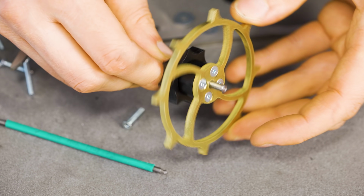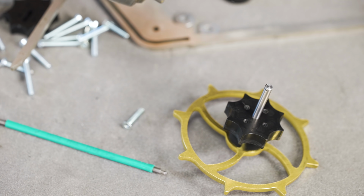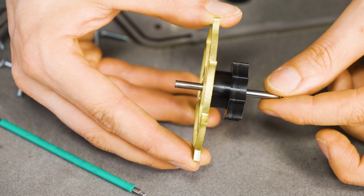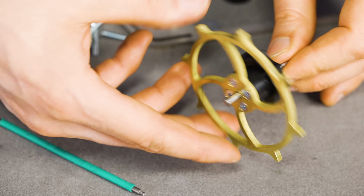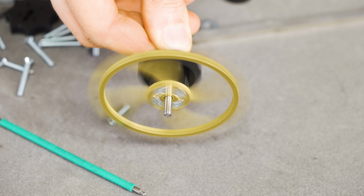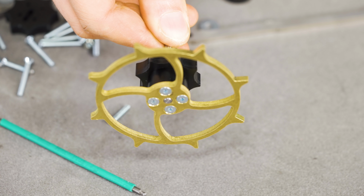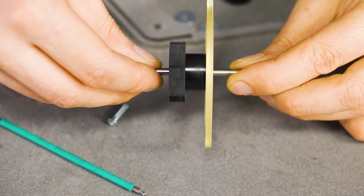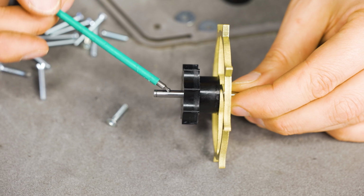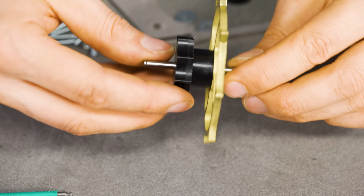The gear is not sliding on the shaft, it's binding, so we need to ream this up, and I'm just going to use the drill press and the shaft to do that. So I'm trying to move the axle, and it kind of doesn't move at all, but look at the frictionless. So if we look at sideways stability, you can see that the gear is super straight. The brass is not touching the axle. That hole here is oversized. So it's the POM bushing material that is touching the axle.